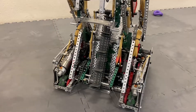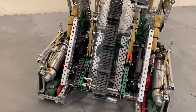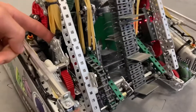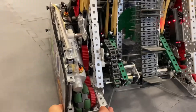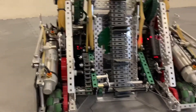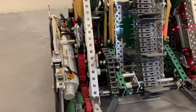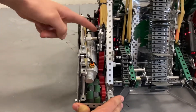The next really important mechanism on this robot, which not many people know about, is what we call the kaboomers. These are little levers on each side connected to the drivetrain with gears. These gears have teeth notched out of them so they can be connected to the drive — but they're disconnected. What we do is at the beginning of every match, we load them up and rotate them down with 18 rubber bands on the top which all pull down.